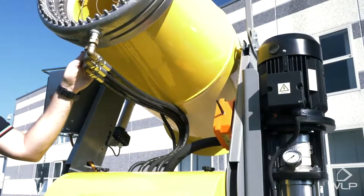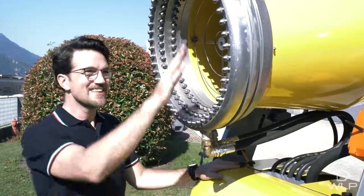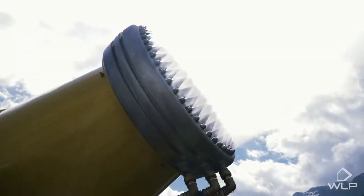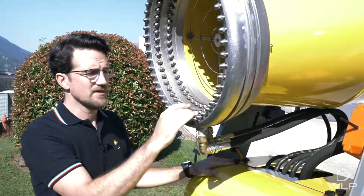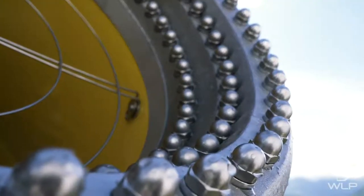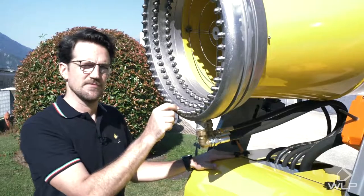This version is electric, but it's also available in the manual version. These three tubes feed the crown of the cannon with water. As you can see, there are three layers which are independent and run on different flows of water — the back row runs on five gallons per hour, the middle one on 10 gallons per hour, and the front one on 15 gallons per hour. These nozzles are in stainless steel and are not welded but screwed on, so they're easily changed or cleaned.